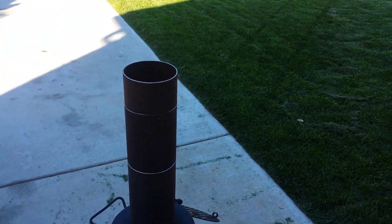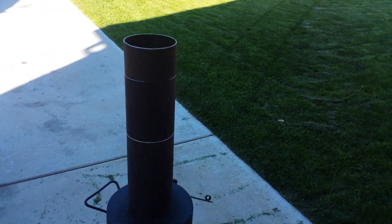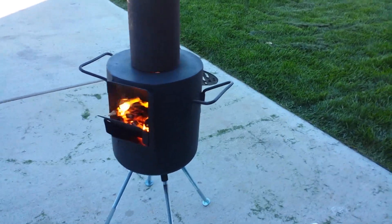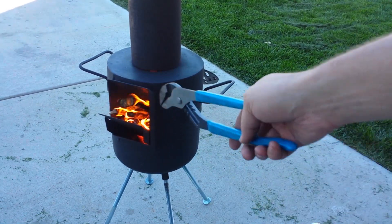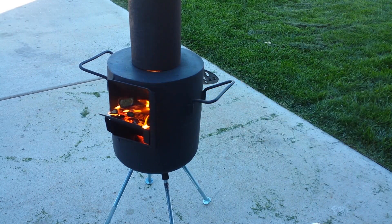See — no smoke. Every now and then you see a little ash come out, but no smoke. It is drafting very well, pulling air in well. One thing I need to do is increase the length of the feed tube a little more. With the longer flue lengths on, the secondary burning air inlets are no longer showing any flames, so I'm not sure those are doing any good at this length.